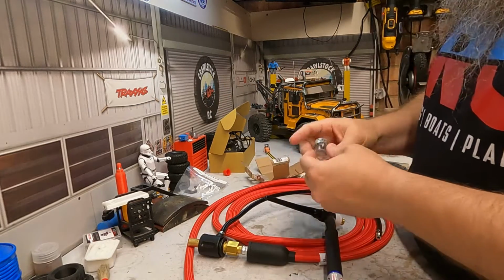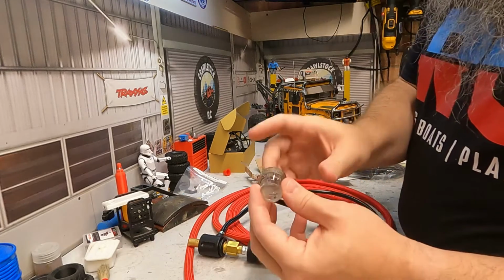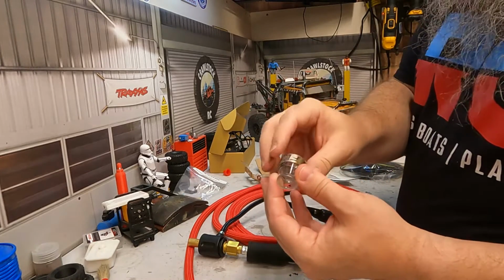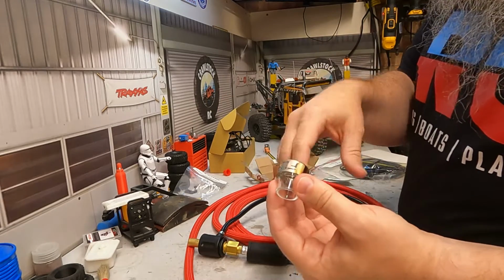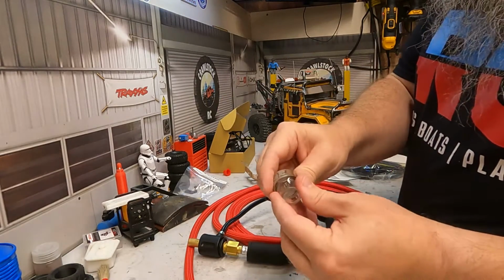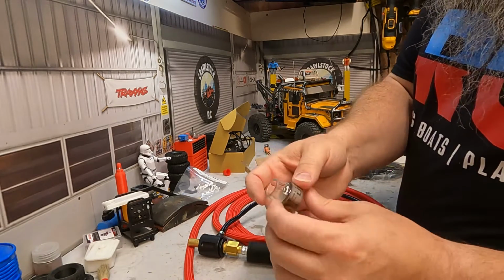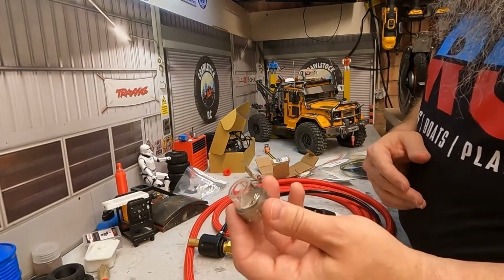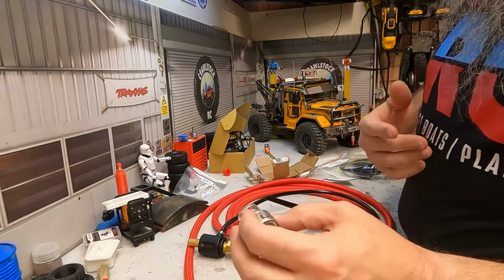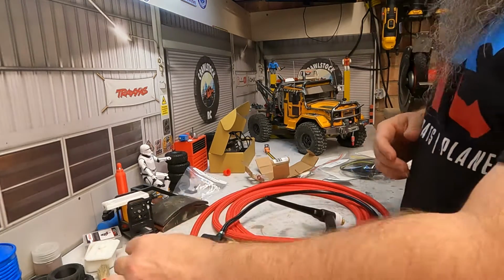One of the reasons I've gone for the glass is because when you are TIG welding, you don't actually produce a huge arc like you do when you're arc welding. So to see what you're doing, any extra available light is a bonus. So I've gone for the glass cup kit, just to try and alleviate the problem of light as well.